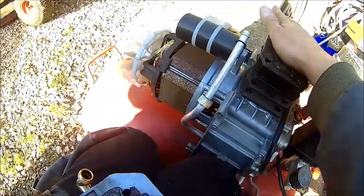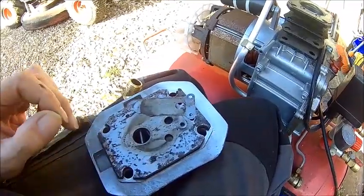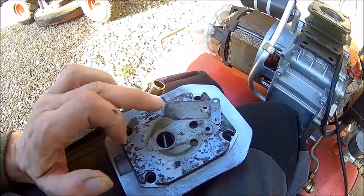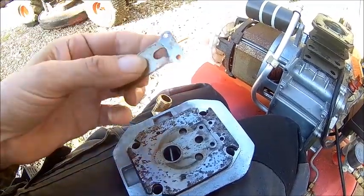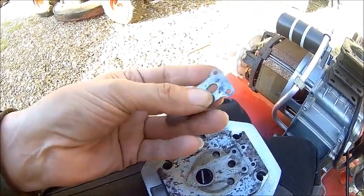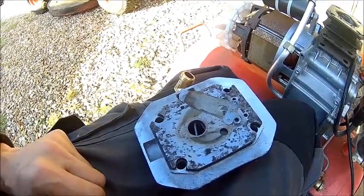If I hold my hand on the piston and turn the wheel it holds the pressure. So the problem is the cylinder head — the outlet reed is fine, there's no problem with that. It's just the intake reed, needs a bit of rework. It doesn't look cracked, it's just dirty. So all it needs is a good clean and then we're probably good to go. Let's try that.